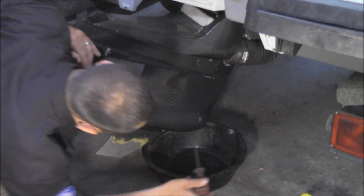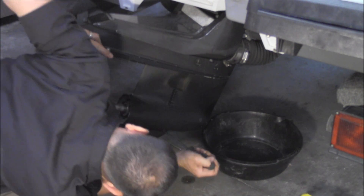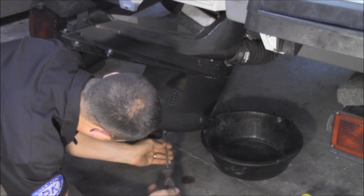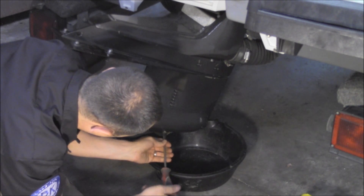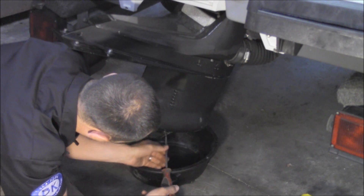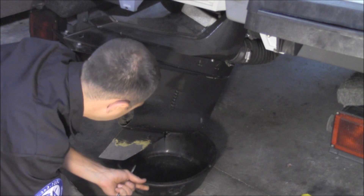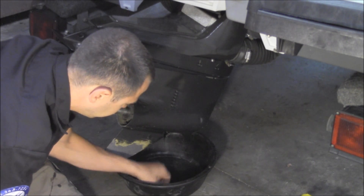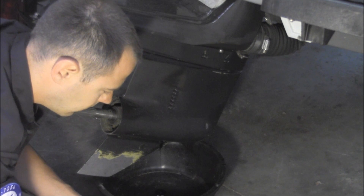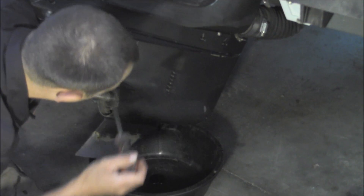The easiest thing to do is to always start by loosening the bottom case bolt. By doing the bottom one first, generally speaking, you don't get a bunch of oil come out until you release the vent one, so it saves from a little bit of mess. Watch carefully because, just like this, there's generally an O-ring gasket on these bolts — you don't want to lose it. You can see it's just slowly coming out.